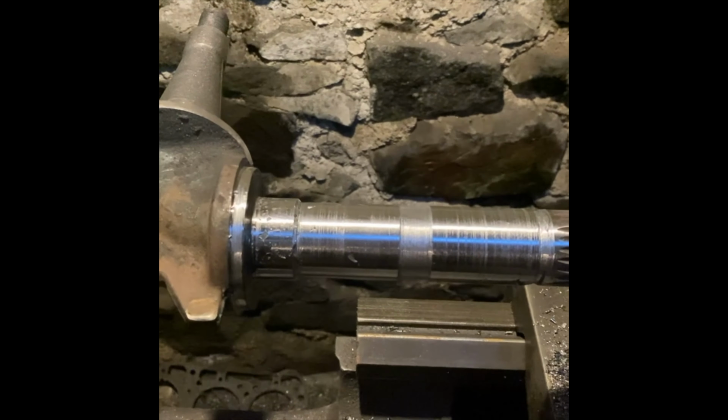Well, when I put the phosphor bronze bushes in, they're wrinkled inside, so I'm making this mandrel to see if I can bang it through and put them back into their normal shape. Then we'll get the kingpin in. I have cut them a bit with a hole saw, so that's been helping. I made a mandrel the same size as the new bush, so I've just barred that through after cutting everything. I'm going to leave it sit there a while and knock it out again. I think when I put the new bushes in on the other one, I'll have something solid in the middle of this mandrel. That should solve the problem.